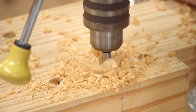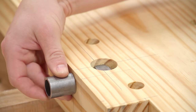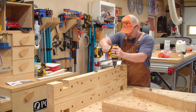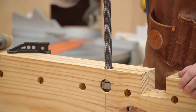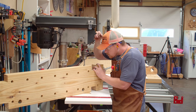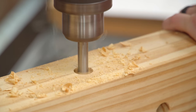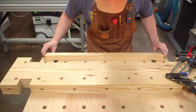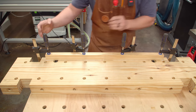With the locations marked the holes are drilled. The square nut goes into the hole and the bushing goes into another hole in the front face. That hole is drilled twice — first at the drill press and then followed up by hand with an overdrive bit and a bit extension. The threaded rod should pass through the bushing, engage the nut, and then go into the open space beyond without touching any pine — this ensures smooth operation of the screw. While the drill press is still set up the dog holes on the back face can be drilled, just making sure not to go deeper than the length of the dogs. Finally the extra piece can be glued to the bottom of the front edge to give more material support to the stationary face of the vise.